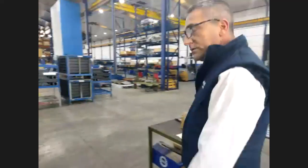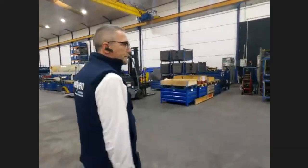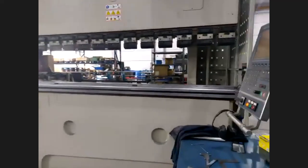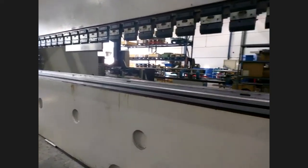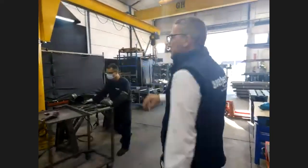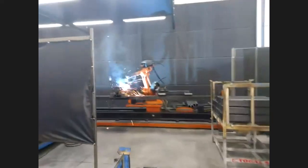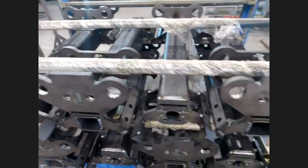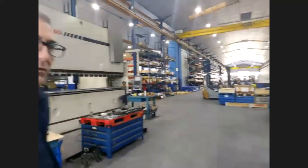We go on in this machining area where we are manufacturing all these parts. We can see here on our right hand the bending machine — it's bending sheets of iron. This is a 400-ton strength machine and six meters wide, for bending mainly the posts. And now here we are in the welding area. We can see the robot — the automatic welding robot. It's welding these parts: the lifting wagons, which are completely welded here with our robot welding machine.